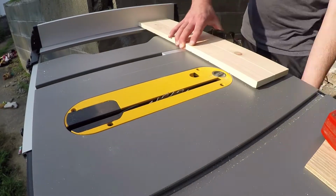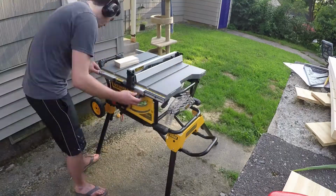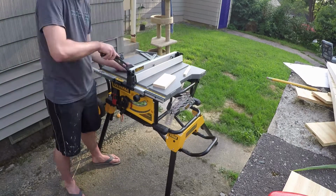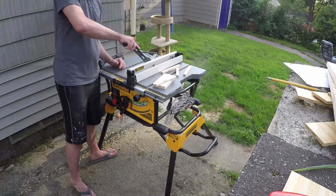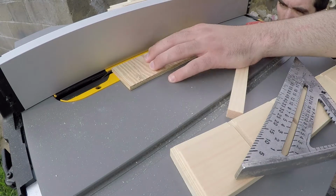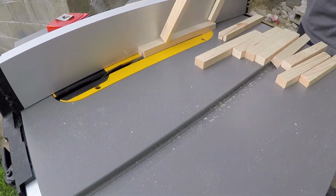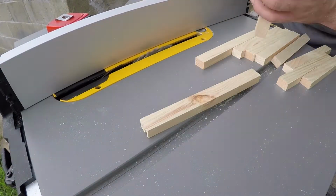With the shelf slots resolved, I go back with those 7.5-inch boards from the 1x4 and I strip those down so that they're about 9/16 wide, and those are going to become our front trim pieces later on. Now the way to notch these boards is going to be the same for all, but I'm only going to show it on the first two in the interest of time. I set the table saw depth to about 1/4 inch again, and then I notch the back of these trim pieces, that way the shelf has somewhere to sit.